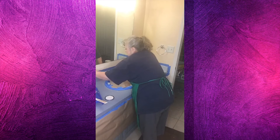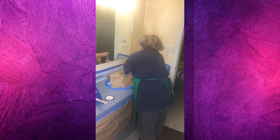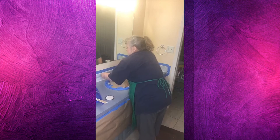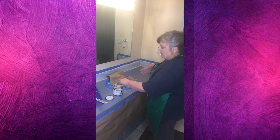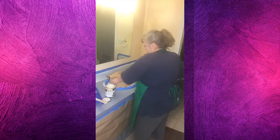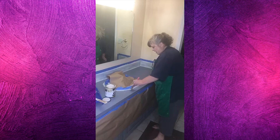I'm impressed that this part dries pretty fast. I read it's about 30 minutes between the first and second coat, then a couple of hours between that and the final stone coat, and a couple more hours between the coats on that to get it how you want before you start sanding it. At the very end after the top coat is on, it's just a 24-hour wait to dry and seven days cure time before it's like a countertop you can use forever without worrying about it.